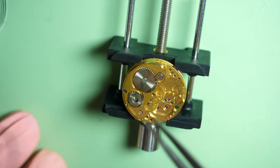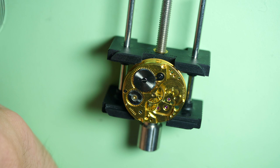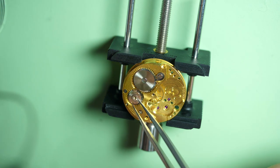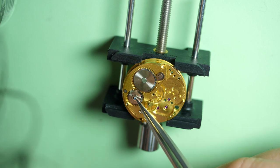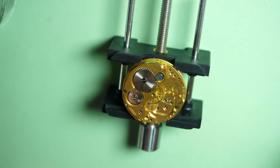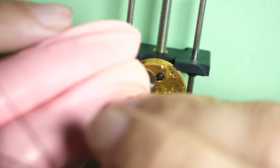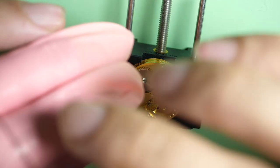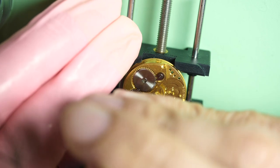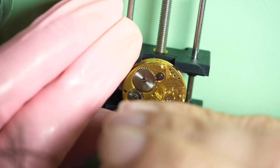I put a bit of 9010-4 to make sure it's lubricated properly. Let's put the top and the screw at the end. Remember, this one is counter-clockwise, so when you put it in you have less risk — you're just not going to accidentally screw it down. If you go the wrong way when tightening, it will break. Just a little check to make sure everything looks properly engaged.